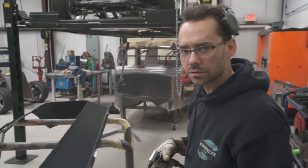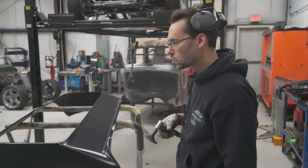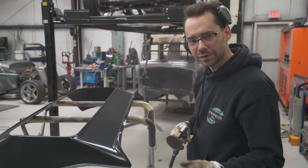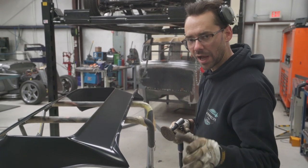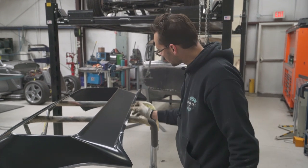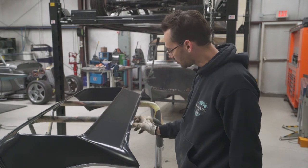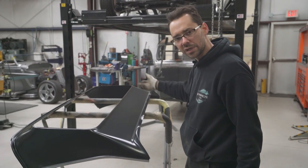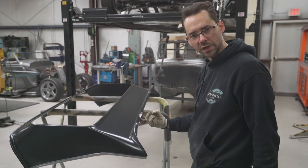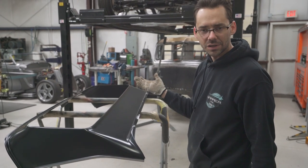One thing I forgot to do. We can use the old one as a pattern, okay? Sometimes you forget, you mess things up, you improvise. So what we're going to do is, I only want to grind certain spots of this down to bare metal. I don't want to grind the whole flange down to bare metal because only certain spots contact the ribs that were on the back of the cab. I should have made some witness marks on here and transferred them to this side so that I knew right where to grind. So I didn't do that.